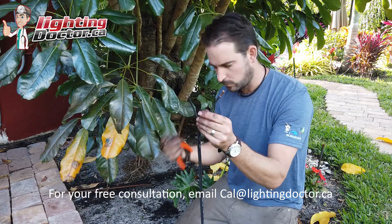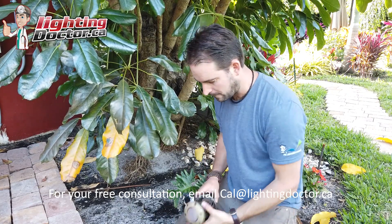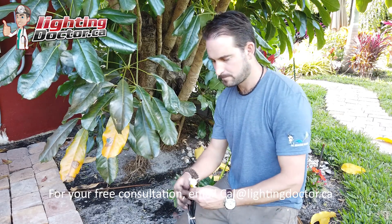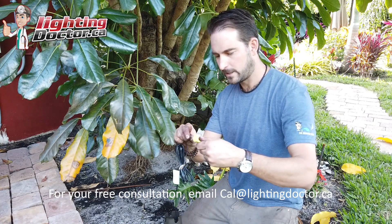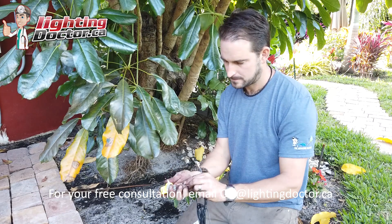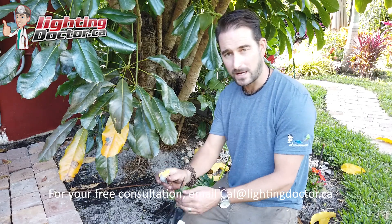So in that last light, what we're going to do — I've got my 12-2 wire split already and I've got my wires from my fixture. I'm going to take my waterproof connector and in our small terminal hole I'm going to place one of those fixture wires and one of my 12-2 wires, then snap that tight.